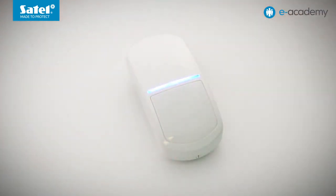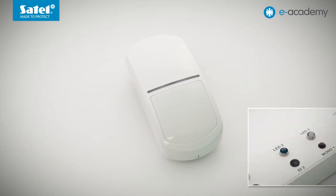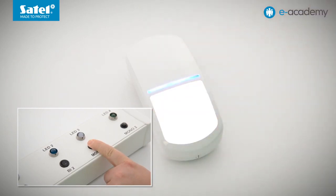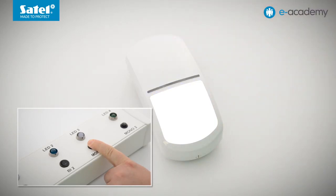You can see that the LED indicator signals movement detection by lighting blue. However, the white LEDs do not turn on, because the Luna terminal is not connected to common ground. To change this, press and hold the Mono 1 button, shorting the Luna clamp to ground. Now each violation of the detector will turn on the lighting for the time set in the detector. When I release the button to disconnect common ground, although the LED indicator signals motion detection by glowing blue, the lighting does not turn on. Pressing the button again, after motion is detected, the white LEDs light up — which means everything works okay.